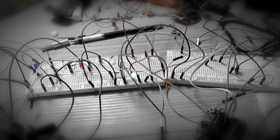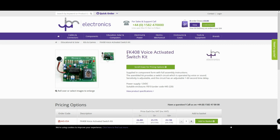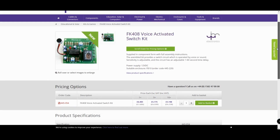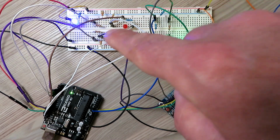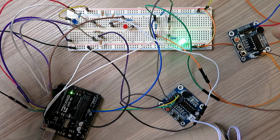Now, I'm going to make two designs. The first will be an Arduino controlled device, and the second will be a 100% analog device using a very cheap off-the-shelf control board, so something anyone can make without having to worry about Arduino programming. Although, to be honest, it's much easier and more flexible to use a microcontroller like an Arduino. You can actually set the ISD boards to record at 20 seconds in length, but you will lose some audio quality. So the nice thing about using a microcontroller is that you can simply add in more ISD boards if you want greater length recordings, or a low battery warning say, or a tamper warning if it's remote, etc. Totally flexible, few lines of code and £1 per board.